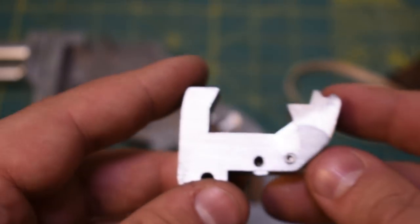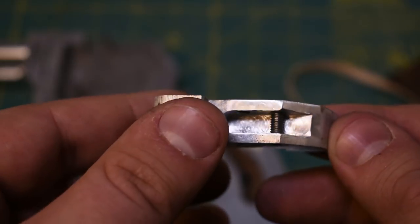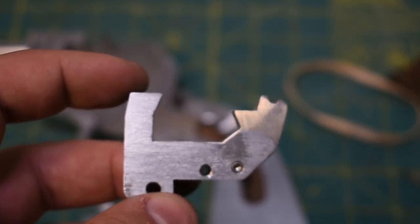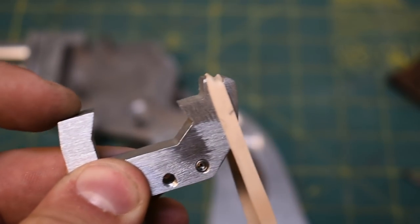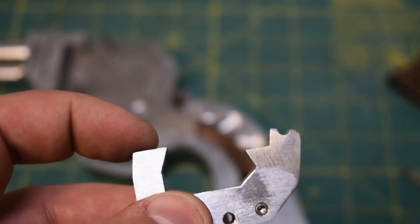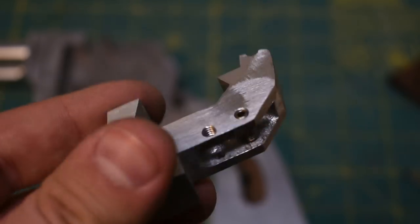This is the escapement — a very simple two-dimensional part. I cut a slot out in the bottom for the spring to sit in. The original plans I had used rubber bands on the inside, with the idea of hooking it around this thing. I didn't like that because it would need more clearance on the sides, so I just cut a slot and put another set screw in.